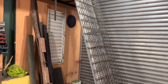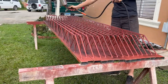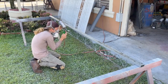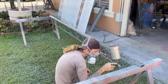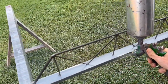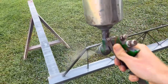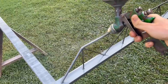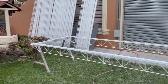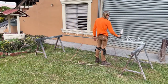With a large pile building up, we tried several painting methods and settled on spraying gray industrial paint first, then white, then gray again — a three-coat system — so I could verify even coverage from each angle and not miss any spots. One danger with a bar joist is that if you miss a spot and a bar rusts out and breaks, the joist can fail easily. Once installed, getting paint all the way around each bar is more difficult, which is partly why you don't see this style built as commonly.